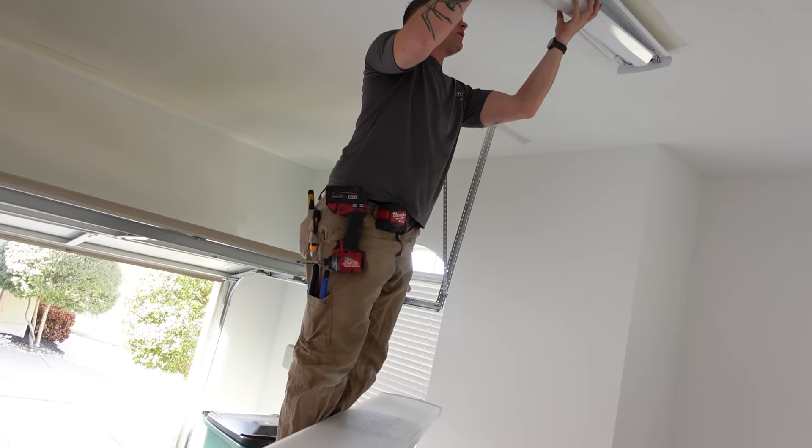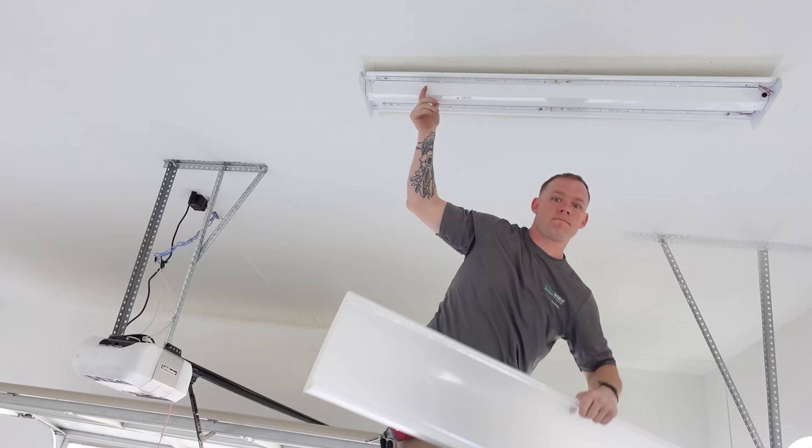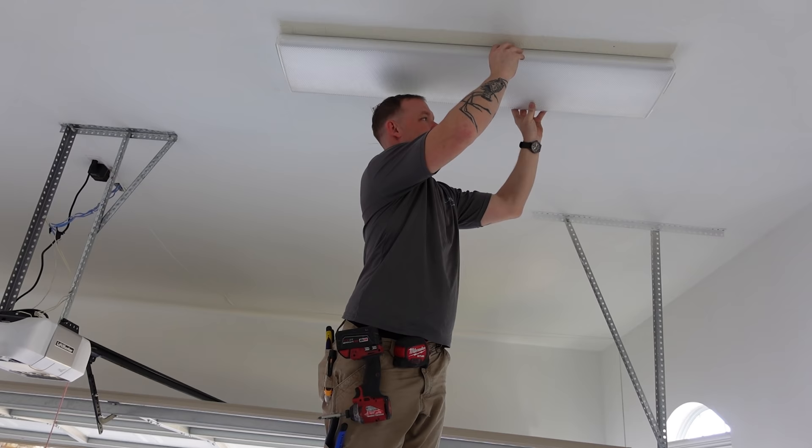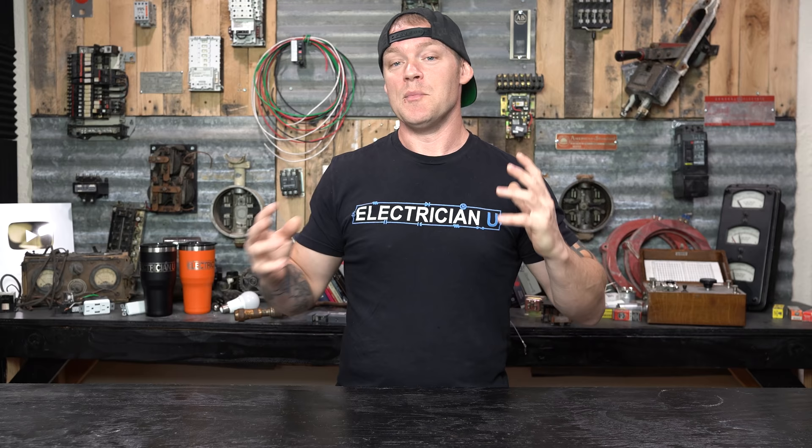Then I install the belly pan. Being that it's LED, we don't have any bulbs to put in — that's pretty rad. Now all we have to do is put the reflector on. A lot of times people break these, so you have to have some finesse. There's a sweet spot where you bend one side, hook it on, then bend back a little and get the other edge over. The reflector is just supposed to hang there. If you break one, most often you're going to have to buy a whole new fixture. So really take your time putting lenses back on fixtures like this because they break all the time — it'll be just one little corner and everything you just did is ruined.